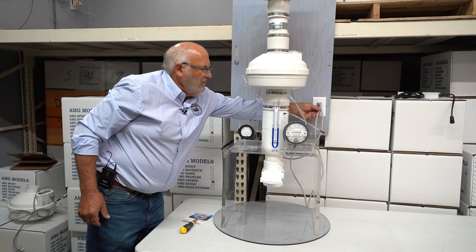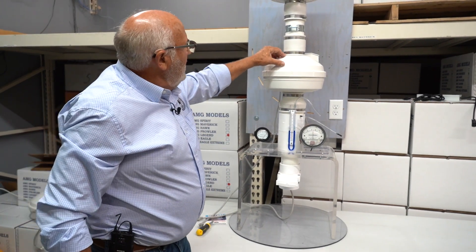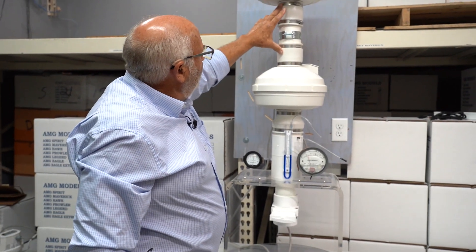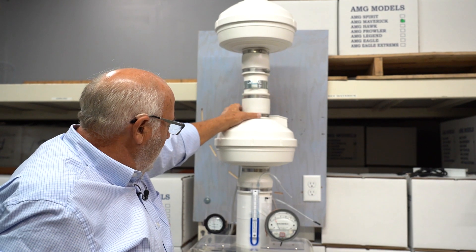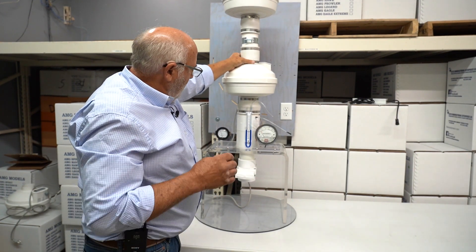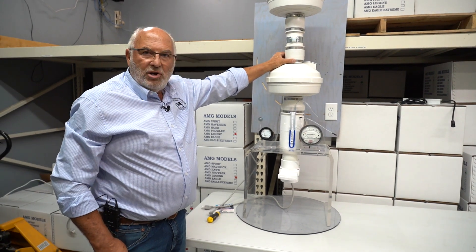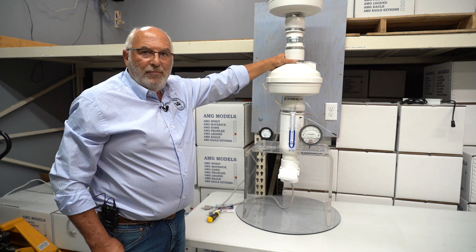I want to talk a little more about the benefits of double stacking. FESTA organization very much approves of double stacking their fans. You should check with your manufacturer if you're not a FESTA user to see their position on it. FESTA recommends eight inches minimum of pipe between the two fans, similar to what we've duplicated. Some of the benefits from double stacking are of course pressure and flow. The places you're going to use them are large buildings with fewer stacks, and also homes that you're just running out of answers on. It's not rocket science — it's a very handy tool to help you out in the right situation.